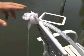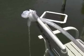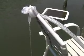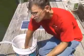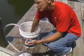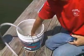The height is about three feet, although you've got maybe a foot in the bucket. As the level goes down it will obviously slow down, and it appears to be doing a pretty good job. I'm going to hold this pump down in here to drain the bucket. Water's still coming out really good — getting pretty close to the minimum level. Okay, that's it — one minute five seconds to empty the five gallon bucket, which I'd say is a pretty good success.